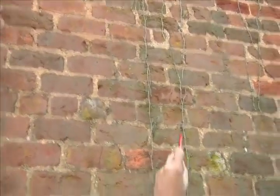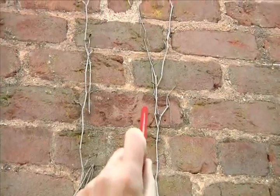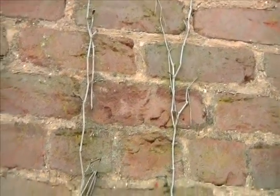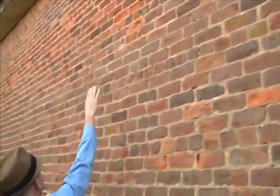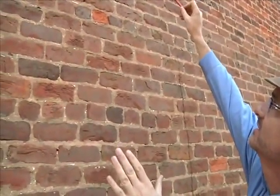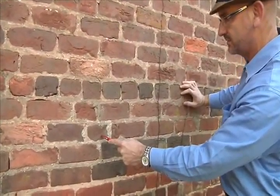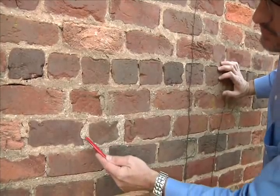If you follow that line along here, you find another one — that one right there, that little square one. See the running bond and all of a sudden you hit a small one. There was no reason for him to go along with brick and suddenly put a small one in. He starts on the end with a pole, puts one here, comes along — his board will span about this long — puts another one, just a wood pole. Look there, he puts another one. No reason for that because that's not a bond row; the bond row is just above it. You can tell that mortar is a little different. That looks like another place for scaffolding. There's no reason he went from that to that. See how that looks patched in, but with an original mortar.